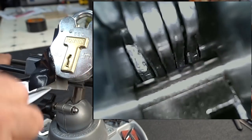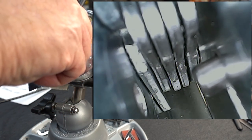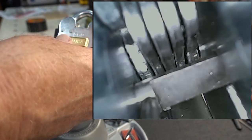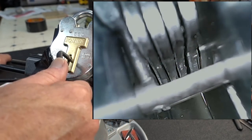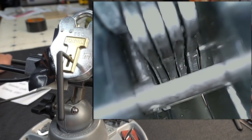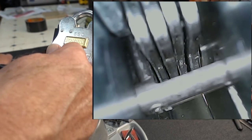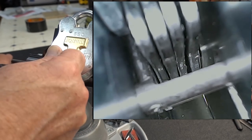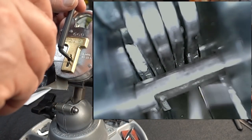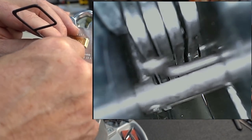Let's lock him back up, pull the key out, and now let's see what happens when we use a lockpick. I'm going to slide my tensioner in — notice it fits into the same hole. We rotate that around, and the terminal step slides into the talon. This terminology all came from KitBear, part of my lever lock education. Now with tension applied into the talon via the terminal step, you'll notice all those wafers are moving a little bit — they're all under some pretty serious tension — but we won't get it open because they're not lifted to the right height. Let's put a pick in, rotate the tensioner back, slide the pick in, keep everything aligned, rotate it, and slide back into the talon.